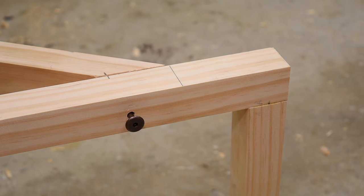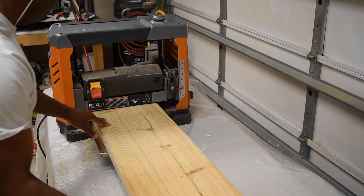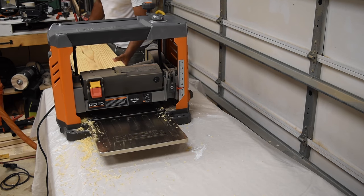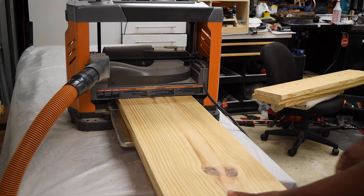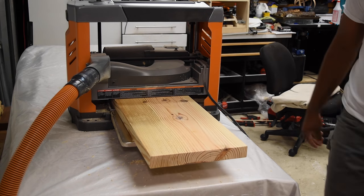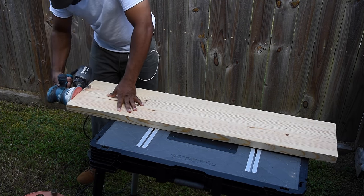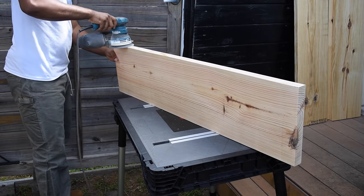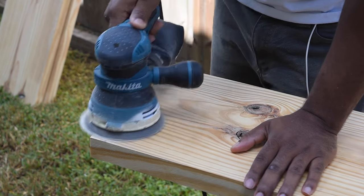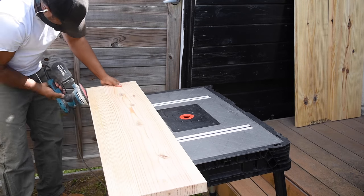At this point I can sand everything down. I didn't want to go through a ton of sandpaper, so I pulled out the planer to remove a few layers off the rough lumber. My goal is not to flatten the board — I'm just taking off layers, which you can accomplish the same way using a belt sander or orbital sander. There's no escaping the sanding process; I just wanted to minimize the work since there are many places the planer can't reach, like the sides. I ended up sanding everything three times, which took about 45 minutes — 120 grit first, then 220, followed by 320 grit.